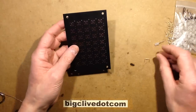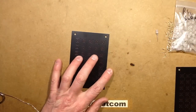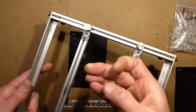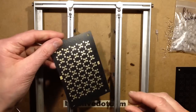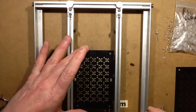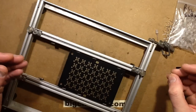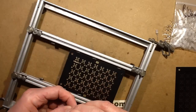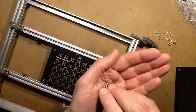I'm going to use the 100 ohm resistors and the colour-changing LEDs, and basically blanket-cover this board. To make it easier I'm going to use this printed circuit board assembly frame — which is covered in dust, I should have thought of that before I started filming. Since people will inevitably ask, this frame came from either Maplin or Rapid and was made by Velleman. I don't think they do them anymore, but it's very useful and holds everything in place well. I'm going to start off by putting the resistors in — these are just 100 ohm resistors, not polarised in any way.